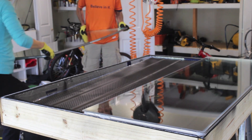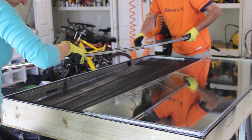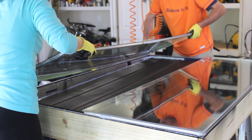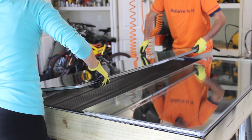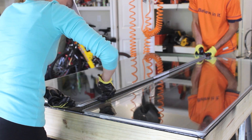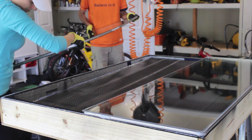Setting the glass was the final step. Be sure to clean it very well before you're ready to go and make sure you have gloves on, because you will put fingerprints on the inside of the glass. In hindsight, if you're going to use a heavy-duty glass, I would not have done what I did — having it sit on the face of the one-by-six. In the future I would use a two-by-six and cut a notch so the glass sits inside.